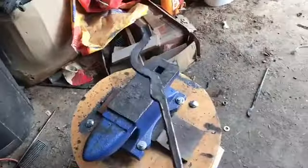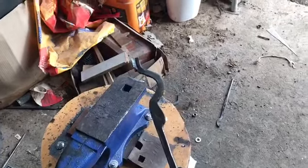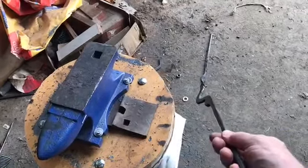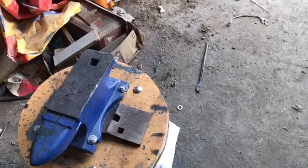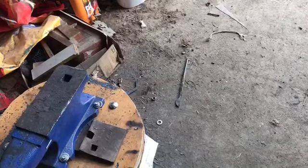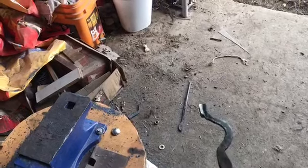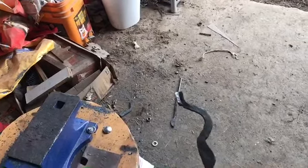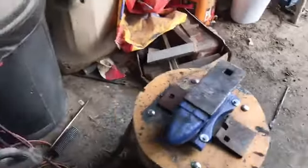I decided to make my own pair of bolt tongs instead. I made these out of a railroad spike — there's the second half down on the ground. I was working on that today for about two hours. I created a stress point somehow, and when I was trying to bend it, I broke the nib off right above the boss area. So I've got to start all over on that — it was about ten minutes away from being finished.